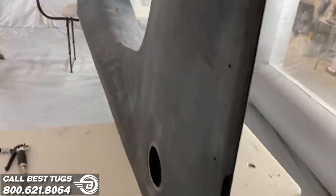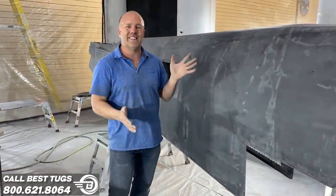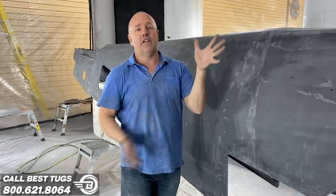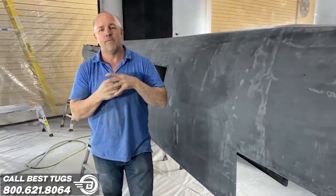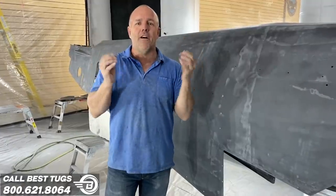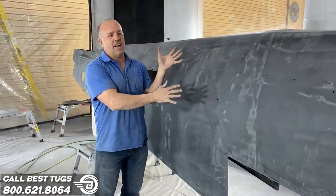I've had a lot of people ask how I did the high polish clear on top of carbon that wasn't done a more conventional way, which would be a plug of a mold, gel coat clear, and then embed the wet carbon into that, or it could be infused or pre-preg into a clear-coated gel, which pops off a part that's already perfect and really nice, maybe needs a little cut and buff. This is the opposite.